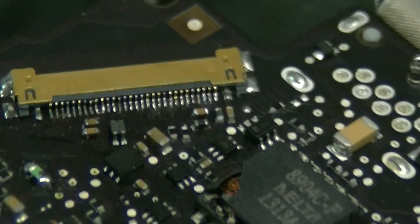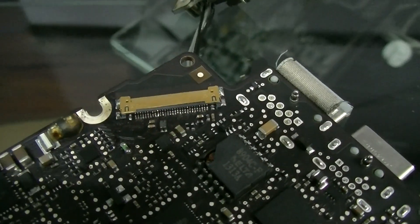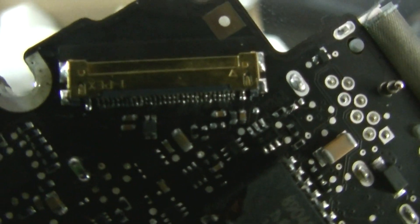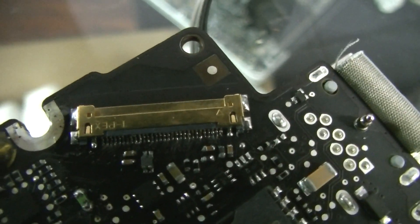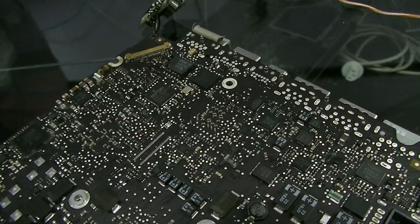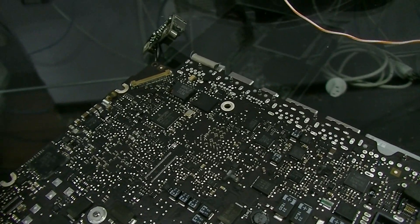Here's my soldered LCD connector — I'll be honest, the soldering is not great. I actually fouled up one of those pins, but I looked at the schematic and it said that pin is not connected. That's one of the best feelings — when you mess something up and realize it completely doesn't matter. It's on there pretty sturdy. So I put the new connector on and got my 0.531 measurement. After that point I had replaced the fuse and the LED driver, but was driving myself nuts looking for a short that was actually in the connector.